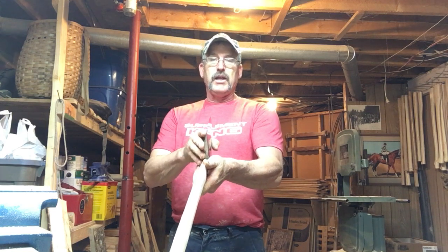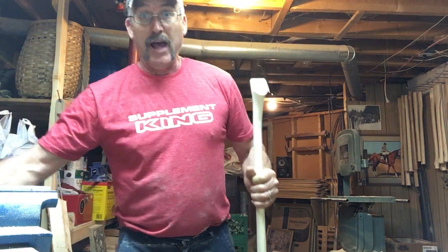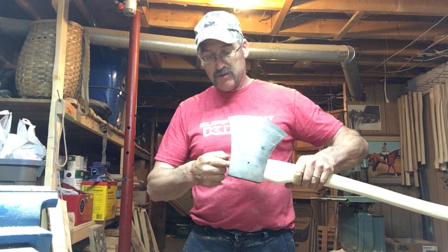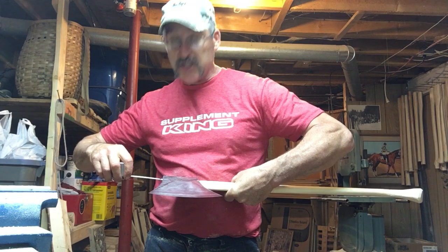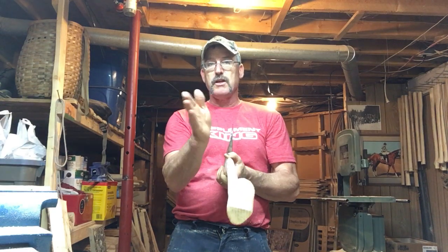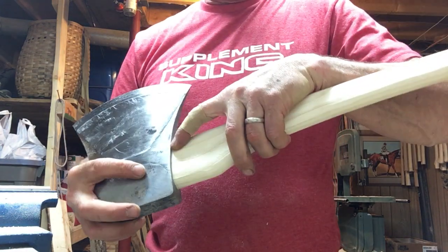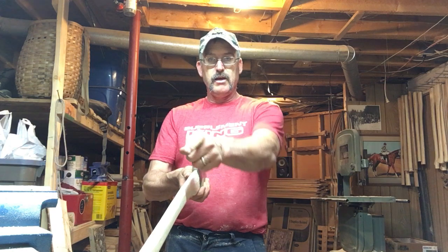It's sitting just off to the side a little bit, but all we took off was down below this. I twisted my head just a little bit to line it up with the middle of the handle. Now I'm going to tap it again until I hear it go high-pitched and I know it's getting tight. I've got about an inch and a half left to go on — this is a four-inch head. I sight down it and we're just a smidgen to the right-hand side of the knob. So I'm going to take a little bit more off, and I can see it's curling up along here on this side but not the other. That tells me I need to take more off of this side to swing that blade more in line with the handle.